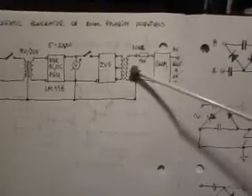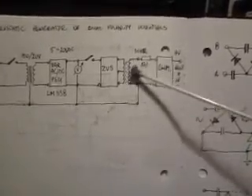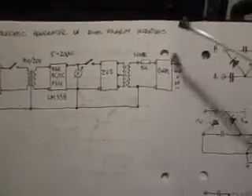All of those I have already have a built-in rectifier, and for the Cockroft-Walton multiplier you need AC — not chopped DC, not tripled. There is also a current-limiting resistor — 10 kilohm, 5 watt — and that feeds the Cockroft-Walton multiplier.